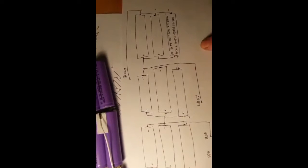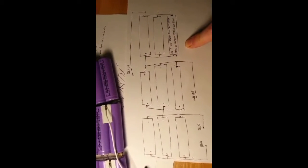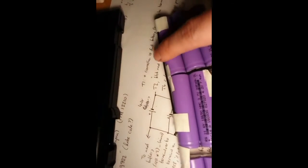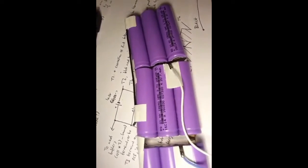Here is another drawing to explain what I just said. On the left we have the positive terminals, on the right the negative terminals. There are three cells in each battery, all connected in parallel, with negative terminals to the right. Each battery is approximately 4.1 volts, and connected together they make about 12.3 volts. Under load that will probably go down to about 12 volts. We have the following taps: on the left, a red wire marked 12 volts; the next one across is a blue wire marked 8 volts; then a white wire marked 4 volts; and finally the black wire, which is marked — it looks like — VO.